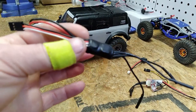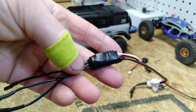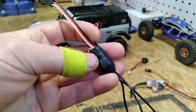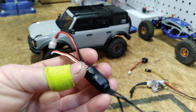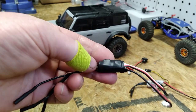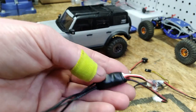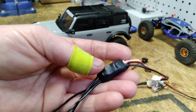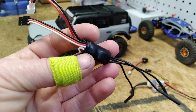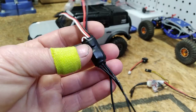The Dinky RC D Drive Micro Sport ESC is also really impressively specced. This is a 2 to 4S capable ESC, and that 4S capability is really handy if you're running it in a crawler with a ton of gear reduction and want that wheel speed, or if you want to do a rock bouncer build where wheel speed is absolutely important. The built-in BEC is a 2.5 amp unit, and when ordering from Dinky RC's website you can specify whether you want the BEC output between 5 and 8.4 volts. However, once they've set it up while preparing your order, you can't change it after that, so it's really important to have it set up correctly for the servos you intend to run.